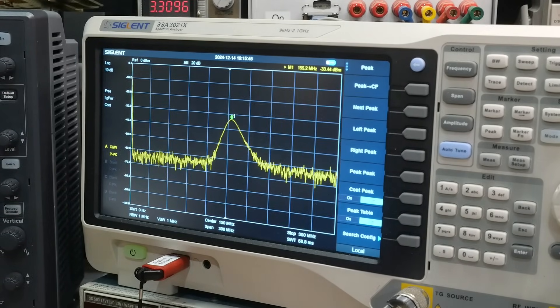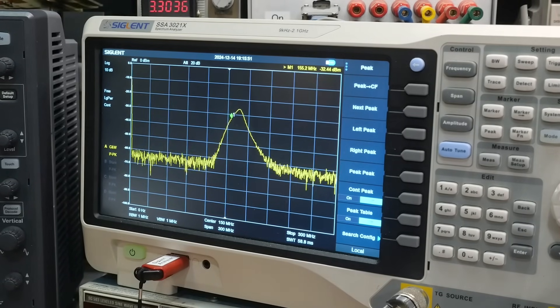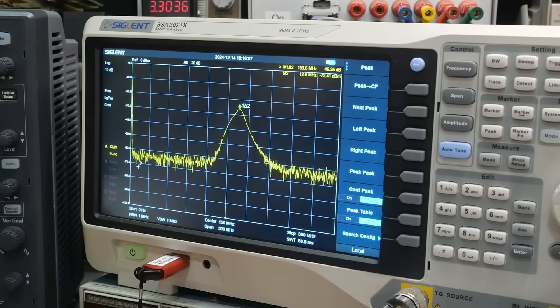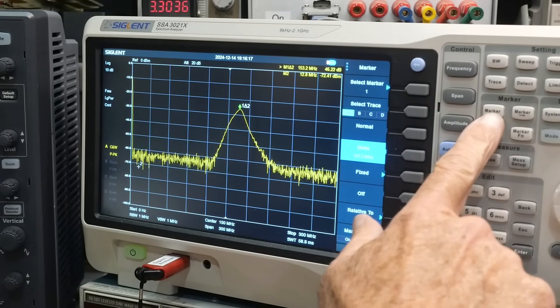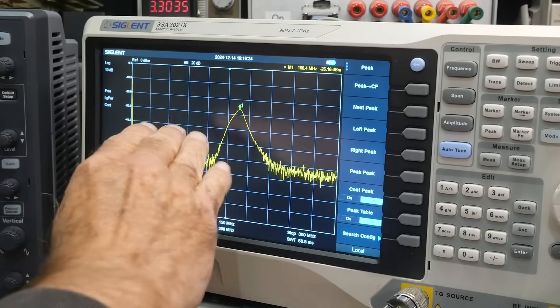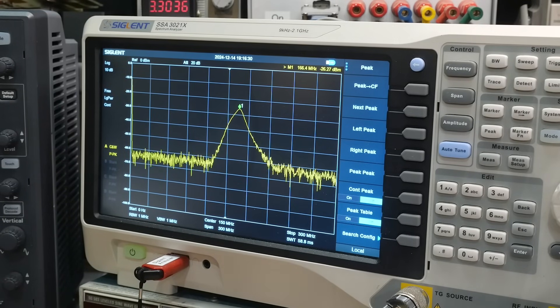Let me put the power on and see if it's doing anything different — it does change shape. If I take the power off, it goes back down. Leaving the power attached and doing a peak search, it peaks at 166 MHz now. So it kind of bent it over — a weird looking shape, but it's not programmed yet and it is acting like a filter.